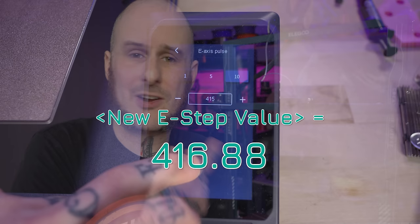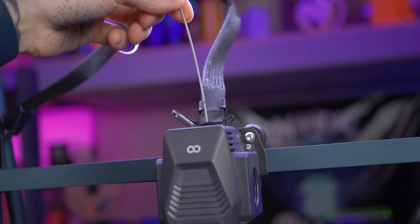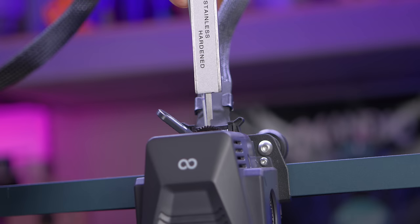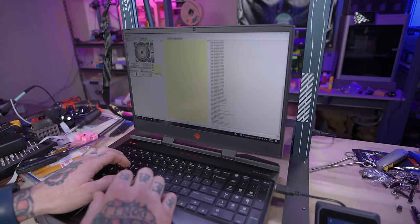On the Neptune 3 Max menu system I can only go in one-step increments, not decimals. If I were using a laptop to remote into the firmware I could go finer, but I'm not that worried about it. I recommend doing this three or four times in a row because you're going to be narrowing in on a good number — your measurement variation has room for error. If your printer's menu system doesn't allow you to see or adjust E-steps, you'll need a USB cable and software to terminal into the machine and issue G-code commands. The Teaching Tech Calibration website has a guide on how to do this.